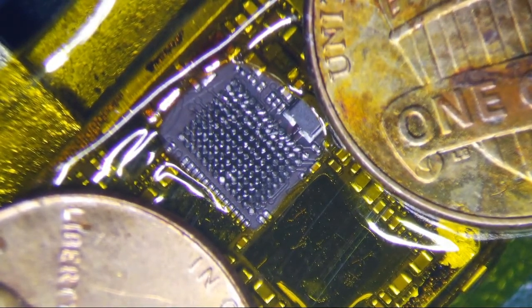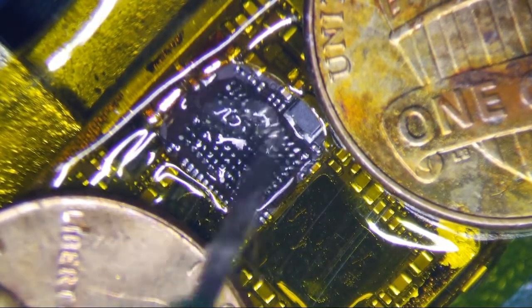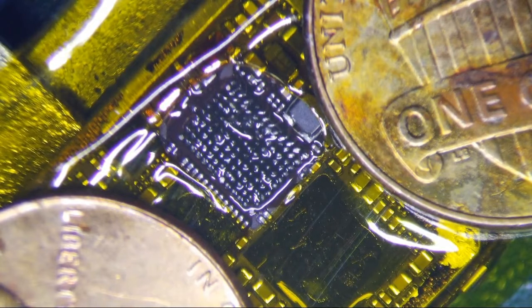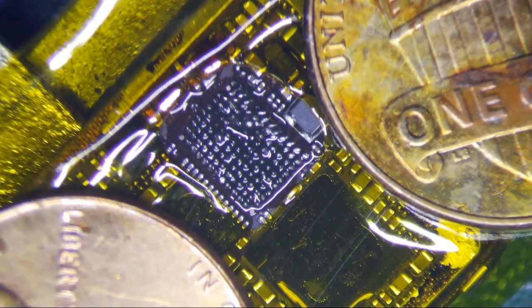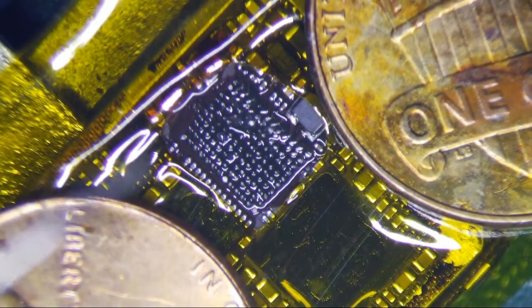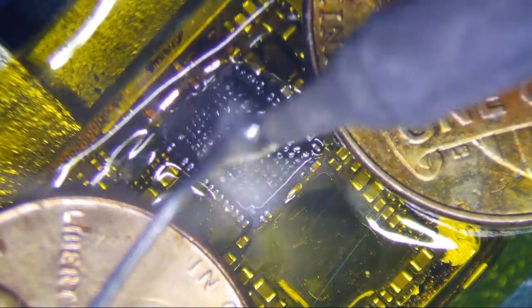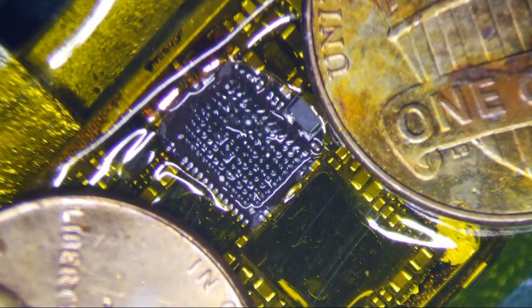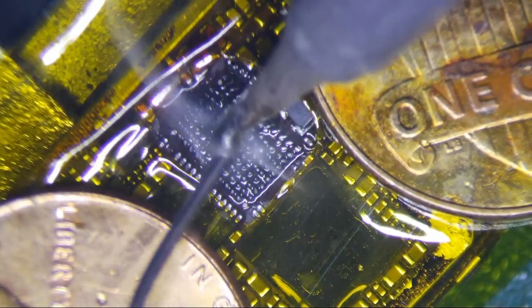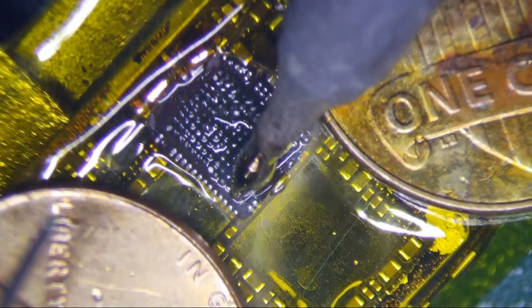So what I normally do next is put some flux on it. A good chunk of flux on it. I get my FM2027 with BC1 tip. Get some 6337 Kester solder, and tin my tip there, and just get a nice little ball of leaded solder, yeah.